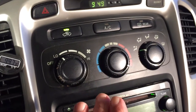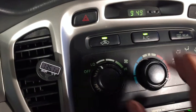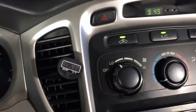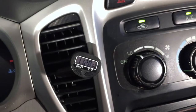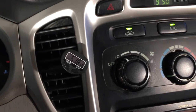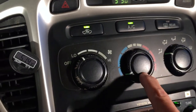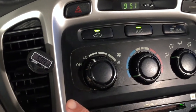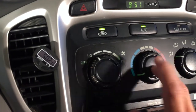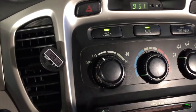I know what's going on because I repaired this probably 10 years ago. I can feel the cold air coming out - 115, 112, 110, still dropping down to 51.6. The AC side of this switch is working well, the heat side is not. The heat was not working until I tapped it, so something's wrong behind there. I think it's another broken wire. Let's get this taken apart and get it fixed.